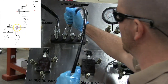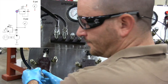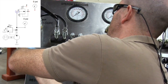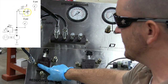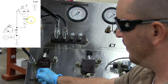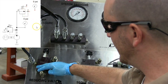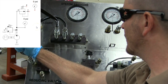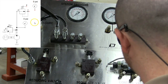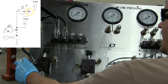So we're going to go from our pump to our input of the pressure reducing valve. Now on this cartridge valve, 2 is my input, 1 is my output, and 3 is my external drain. I know you can't see it on the video, but there's a 2, a 1, and a 3 scratched into these. So my pressure is going to come into here,